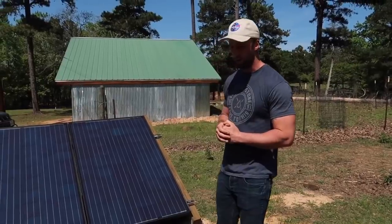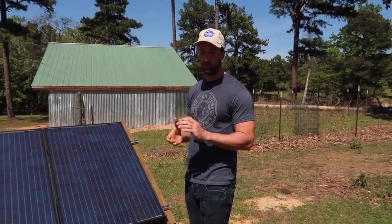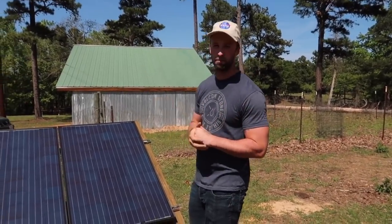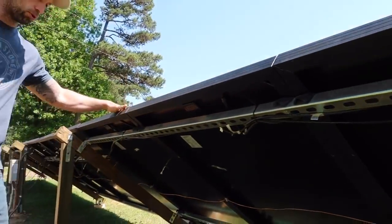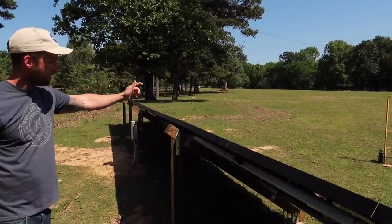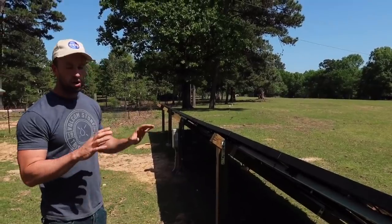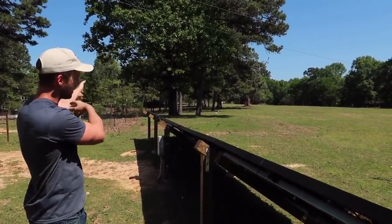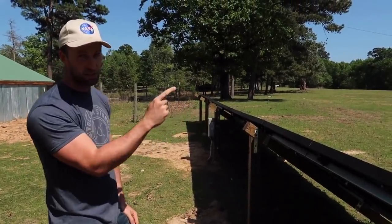Now Spencer is going to give you a little overview of our entire solar system. We have 12 Hanwha 235-watt solar panels - I'll put the model number in the description. We got three in series - so one, two, and three connected negative to positive, negative to positive - and then a positive and a negative that run to the combiner box. That's the same for all 12. So I have a total of four strings in parallel, each one being three panels in series. You can see my grounds for each one - I've just got a six gauge bare copper wire that runs to every single solar panel.